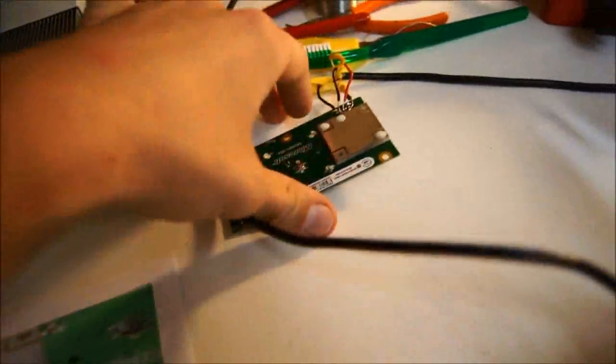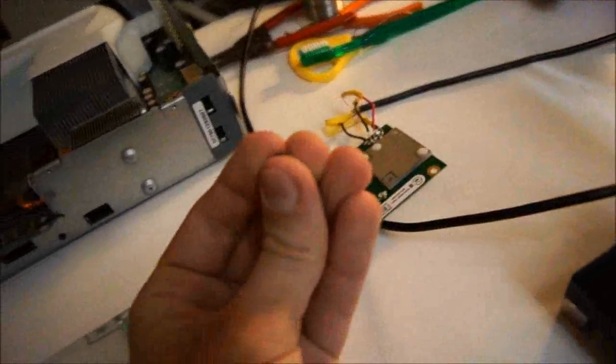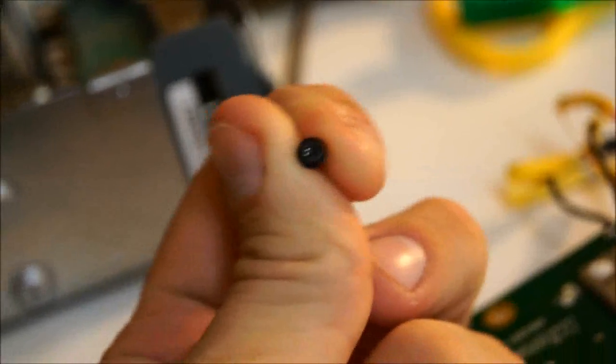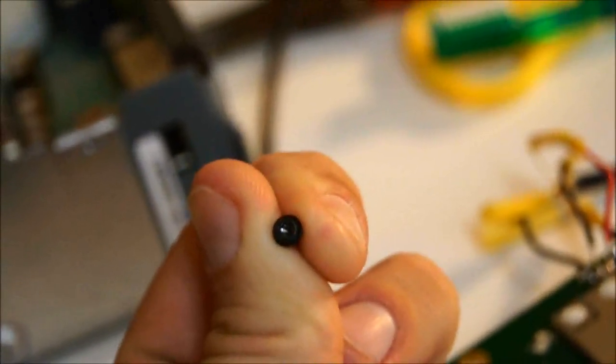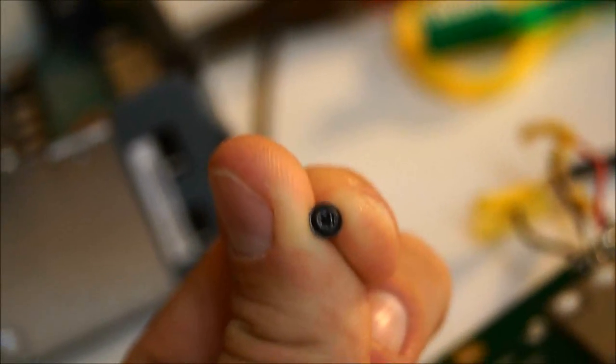First thing you want to do is take this guy off of here. They use these tiny little Torx screws. Now, I don't know if you've ever seen Torx before, but you need either a special screwdriver or you might get lucky and find an Allen key that fits, because they're both 6 stars. 6-sided hex for an Allen key, 6 stars for a screwdriver. Allen keys sometimes work.